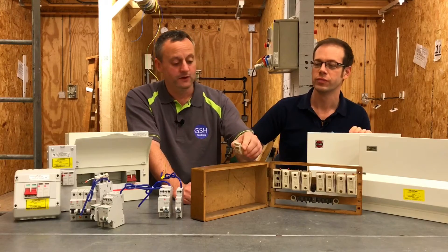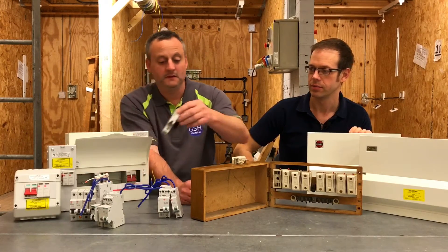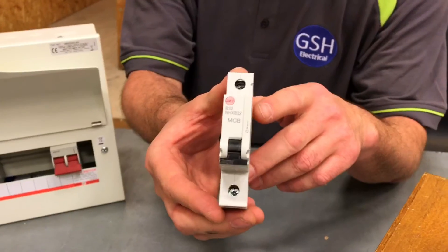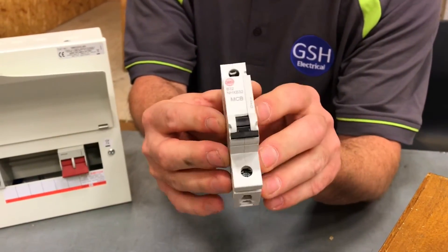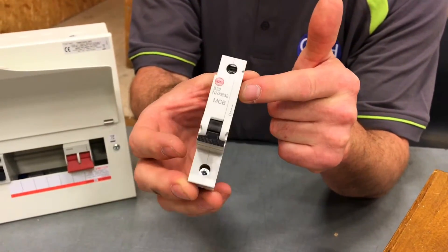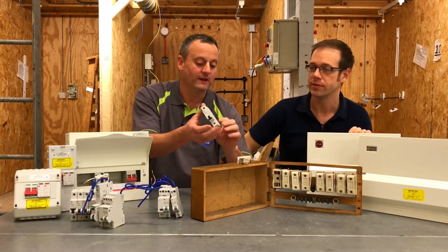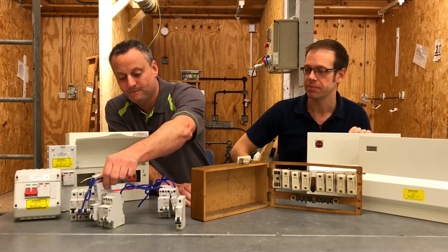You can see how we've moved on, and I almost feel now that this is the poorer family of overcurrent protection devices. The simple miniature circuit breaker does its job and has a lot more technology built into it than a piece of fuse wire, but we've moved even further away from these in the majority of cases in domestic dwellings.